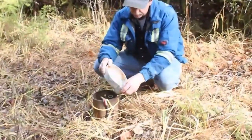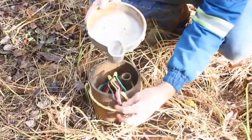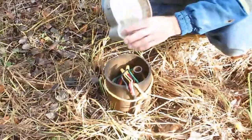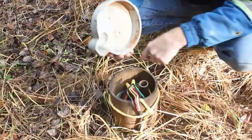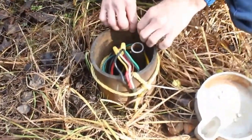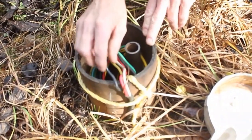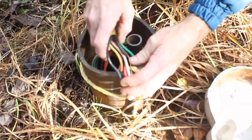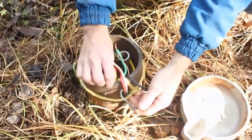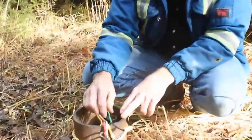There's generally a mechanically protected PVC that comes up here, and a steel pipe to protect the wires that goes into this cap. This isn't properly done because there's no way of actually sealing this against the casing. This casing was just cut off with a torch and it's very rough and sharp around the edges. I just noticed the wire here is just about bared through from rubbing on the top — that can cause an electrical short and energize the casing.